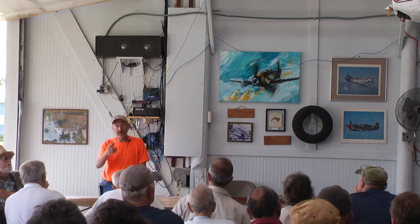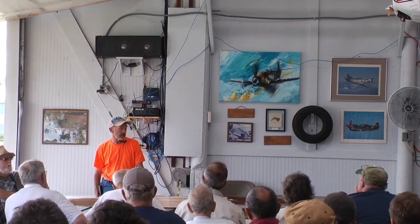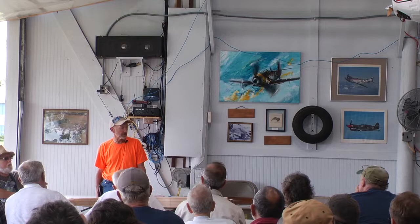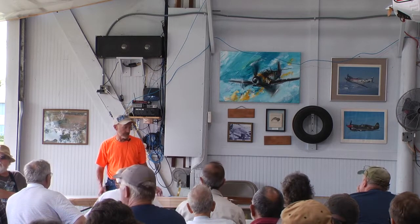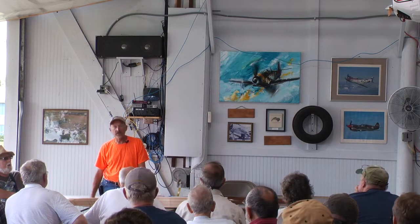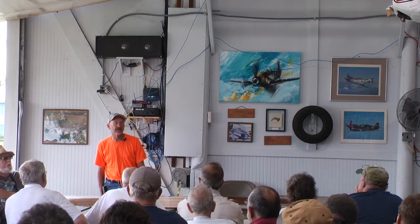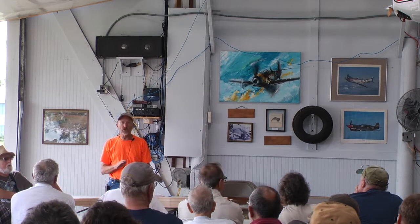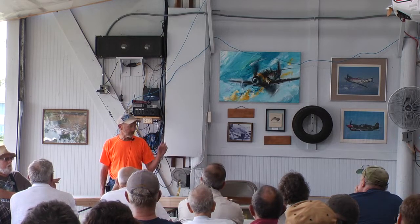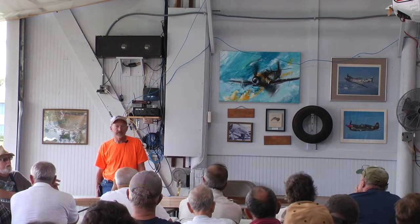I hadn't thought of that, but that's a good idea. What I ended up doing on the propeller that's on my Pietenpol right now, and I was pretty pleased with it, after I made that fork-type fixture, I just wiped on the first couple of coats of thinned out spar varnish. And then having the propeller clamped in that fork fixture, I simply used rattle can spar varnish that I bought from the hardware store and sprayed on thin coats one at a time. I put probably at least 15 coats of that on the propeller and fine wet sanded in between the coats. It takes a long time because you have to make sure each coat is dry before you start sanding on it. But if you look at that finish, I'm pretty pleased with it. It came out really well. It's inexpensive using that rattle can spar varnish.